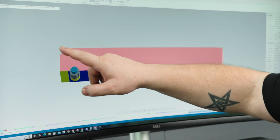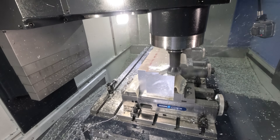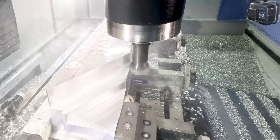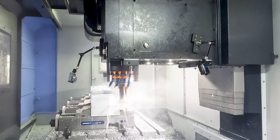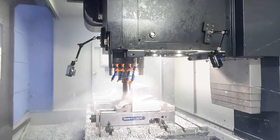We have two big areas on the ends that are going to be completely cut off. We're going to start by removing that material with our face mill as deep as we can, and that's the reason I'm using this face mill instead of an end mill — with this face mill I can reach down about six inches, whereas with an end mill that would be an awful lot of stick out.